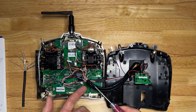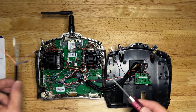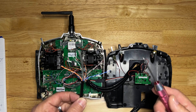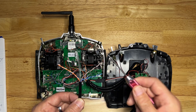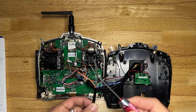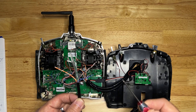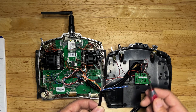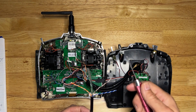To sum up, I'm only utilizing two of the three CAT6 cables. I've color-coded each flight control with strands within the CAT6. I'm using brown as ground. For CAT1, using the primary flight controls — aileron, elevator, and rudder — both strands are ground. For CAT2, which includes throttle, pitch, and throttle hold, I elected to use just one ground. That way I had the other lead available for another function if needed.